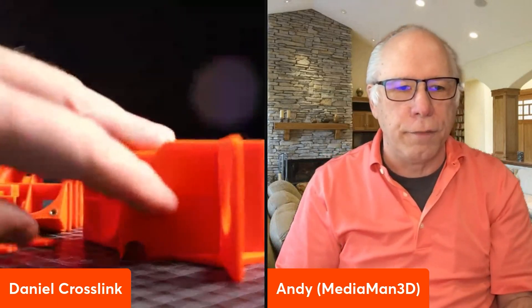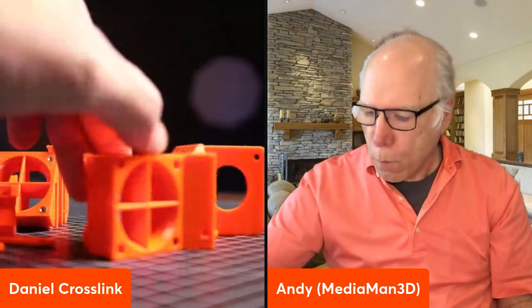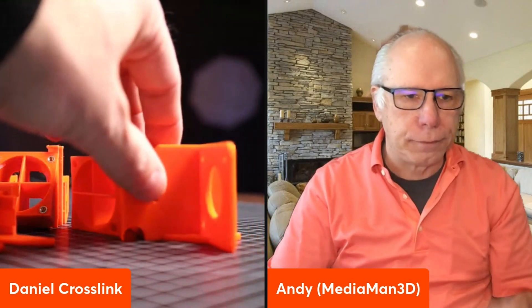There's no longer a place for the PTFE coupling, making it unnecessary. The couplings are not needed because everything is captive all the way from the top to the bottom of the unit. The actual filament path is very short, and the top of the hot end sits right up against the bottom of the HeroMe base — so it's all captive with no flexing. You don't need the coupler in there anymore.